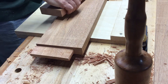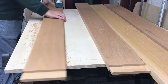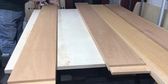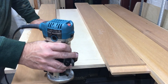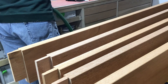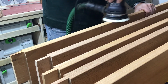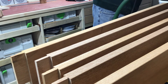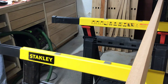One down, now we've got all the rest to do. We've got all the tenons cut and they're all fitted to the breadboard ends. Now we're just about ready to glue it up, but first we want to put a one-eighth round-over on the edges of the boards — we can't do that once the table is assembled. We're also going to sand and finish the inside edges of the boards ahead of time, because it's very difficult to get finish down in that quarter inch gap. So we're going to sand these edges and put the finish on before we put the table together.